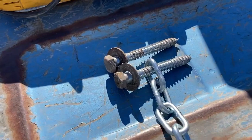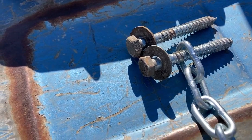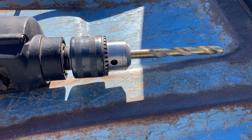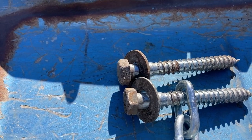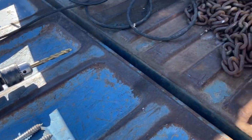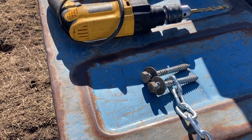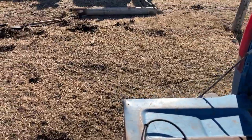So here's the plan. These are half-inch by four-inch lag bolts — just what I had in the shop — and I've got a chunk of chain that fits through them. That's a three-eighths drill bit. I'm going to drill some three-eighths pilot holes that are about 30 degrees off center, run these lag bolts in to sound wood, and hook a chain up to both of them so it's pulling on them evenly. Then I'll be back with the tractor and a chain. If you don't have a tractor, a jackall or anything else will pull really hard. We'll see — either the post will come out of the ground or these will strip out of the post. But I'm thinking if they're at an angle, we should be good to go.